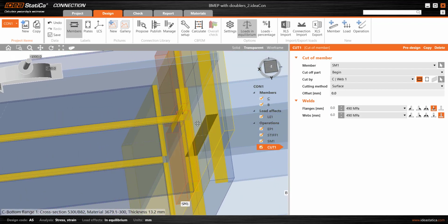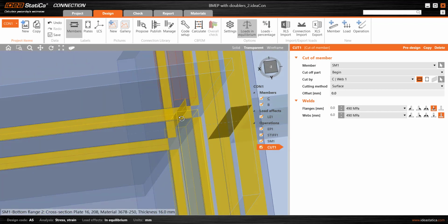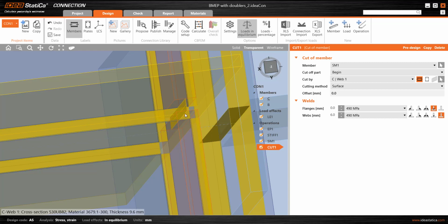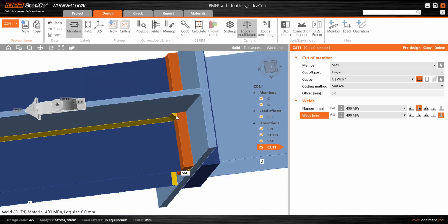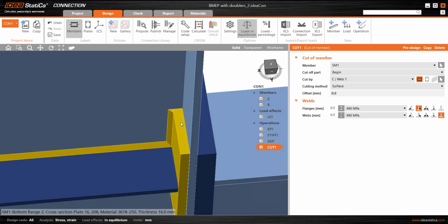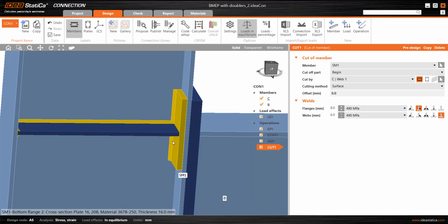If we turn the transparent view on, we see this yellow rectangle indicating the joining of the mid thicknesses of the welded elements. But of course in the solid view we can see the weld more easily if it's a fillet like that. So I might try a fillet weld here. We would typically butt weld it, as I say, but I'm going to fillet weld it there.